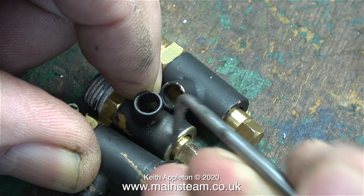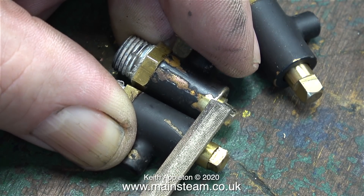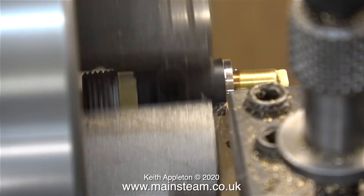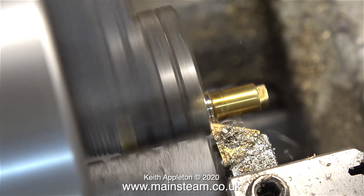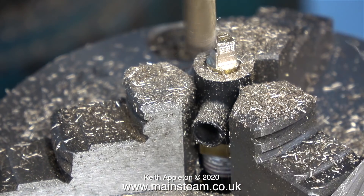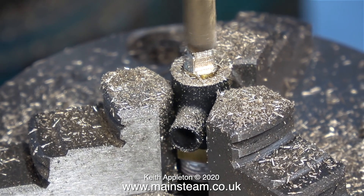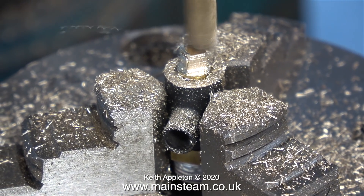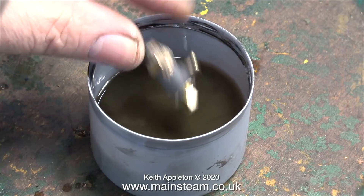Now I need to machine the other one. I'm marking it with a scriber, but as these valves have been in use in the old boiler the paint's very hard because it's baked on. So after making a definite mark with the needle file, I put the valve in the chuck just like I did on the other one and turned down the main body, being very careful not to mark the centre spindle. Then exactly as before it's in the rotary table — I've milled the square part and here I'm milling across the top. Hopefully both blowdown valves should look the same, even though you can never see them together when fitted to the engine as they're on opposite sides.